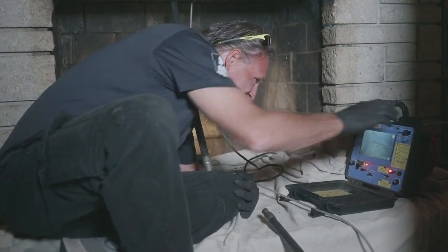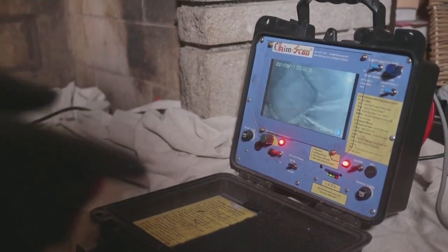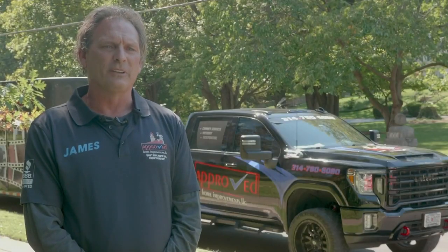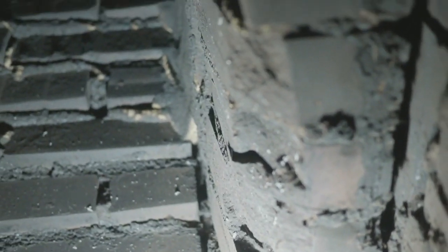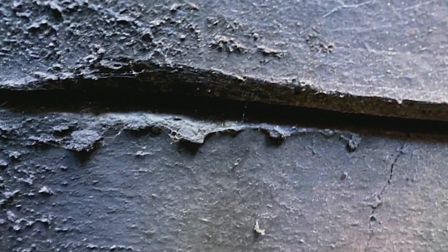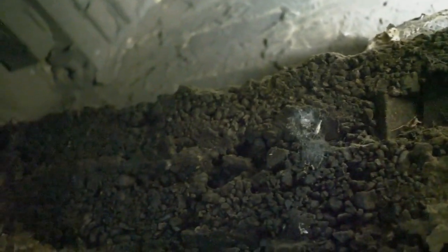James Anderson and his team at Approved Home Improvements performed a camera inspection, and it didn't take long to find the problem. This chimney had gone 60 years without a cover on it — water running in over years, freezing and thawing — basically the entire chimney was water damaged. The mortar between the flue tiles is almost completely gone and the tiles themselves are cracked. These gaps are dangerous; they can allow heat, smoke, even flames to escape the chimney and enter the home.